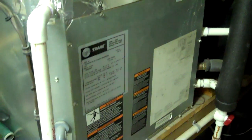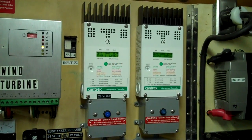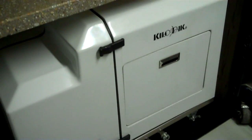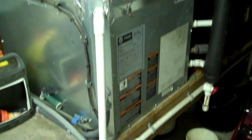My main heating source year round with the grid on is the geothermal. Then when it's super mild and neither the heat nor the AC is running, I rely on the regular grid. Then if the power was out for an extended period of time, I can maintain hot water with the solar, or if I don't use too much, I can actually get that tank hot off solar alone. The last option is to burn my resources by running the generator. Remember, passive solar way outdoes photovoltaics for heat and water — it just happens to be the way I have this system set up. I'm geothermal first, and then I back up from there.